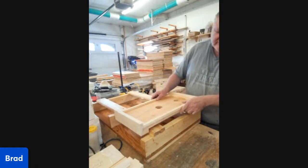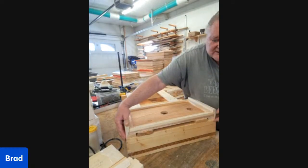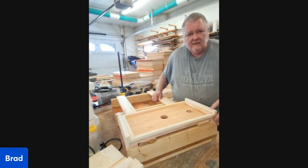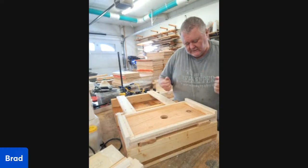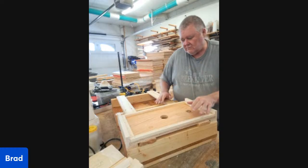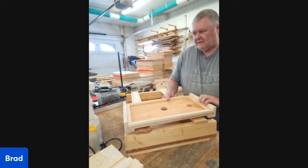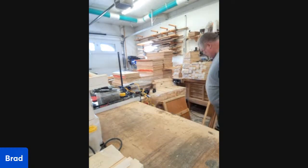The other feature is that the cover is designed, you can see that, to be exactly the same dimension as the pallet. That's so that if you ever strap a load on a truck, when you put the straps over the load and there are multiple pieces, they all pull together. When you tighten the straps, the pallet and the covers all come together at the same time. If they don't, you're going to have covers that are tilting and boxes that are getting stressed one way or the other. So that's why I make the cover and the pallet exactly the same width, or depth. It's a great design. It seems to work really well.